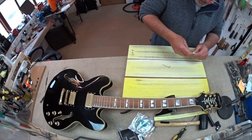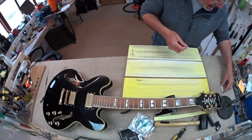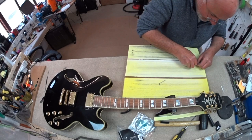So what I will do is I'll take these here, the grub screws, and I'll just push them through for a minute so we can take the thing out of there. This is how we get it out. Clean it up. I'm going to put it down so I know which side is which. And then I'm going to come back to here and I'm going to just withdraw the grub screws until they're sort of almost hidden back in there. And I'm going to just keep this thing dead level and I'm going to sand it down.